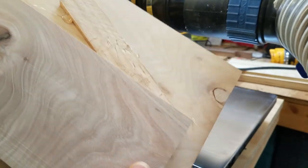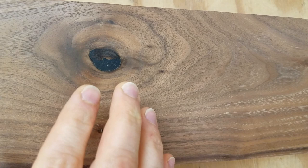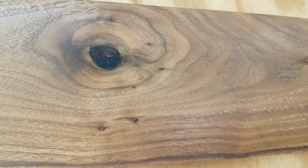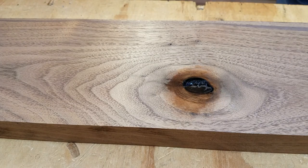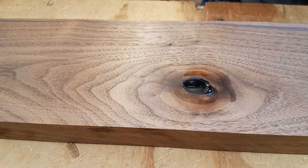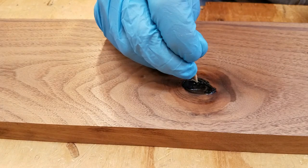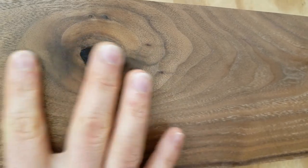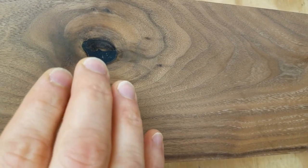Sand to 220 when you're done, even after you've planed, and it'll work really well. On this walnut board, when I was planing it, this knot hole just blew out. It didn't feel loose, so I didn't think to stabilize it ahead of time, and it was just gone — I had nothing to work with for a clear epoxy fill. So I used the medium-thick black CA that they have. I did it in several layers, spraying the accelerator in between each one. I got one layer a little too thick — it was kind of squishy feeling, hard on top but with uncured adhesive behind it. I poked it, and I think that was a mistake. I never did quite get those little voids to clear up. So I think it was my fault — I should have gone in thinner layers. But other than that, it's perfectly smooth and blends in really well. If you want less attention called to it, you might get away with the brown CA as well.